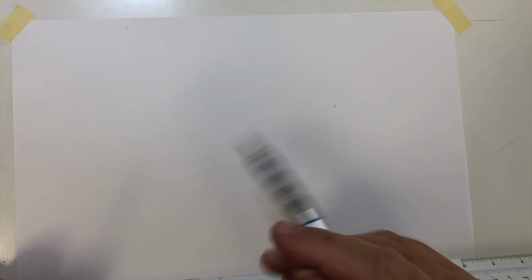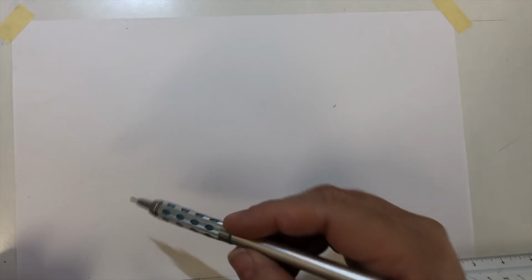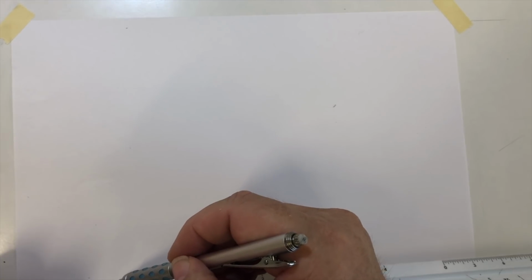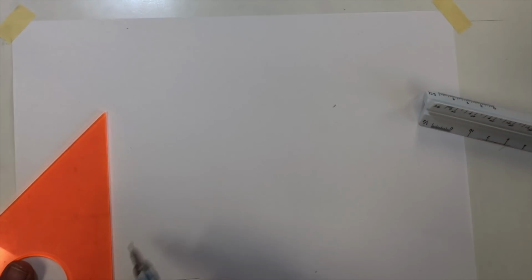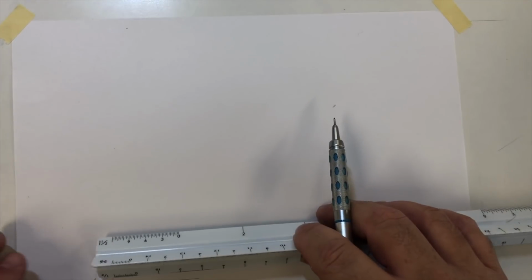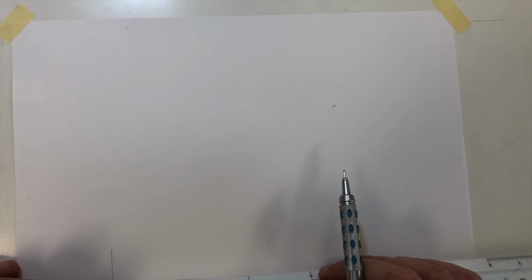Now, we're using a 1.5 inch scale for this detail, and that's what this type of drawing is called. It's called a detail drawing. And I'm going to go with the rule of thumb of 16 inches for my footing. So 12, 13, 14, 15, 16, right there. Okay, so I'm going to use all my tools, and I'm just going to hatch some lines. I think I marked the end of that way.